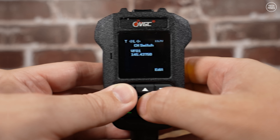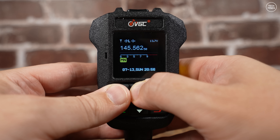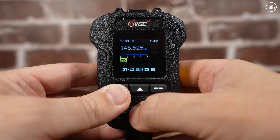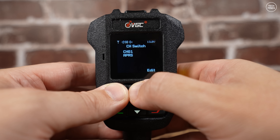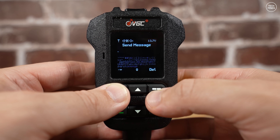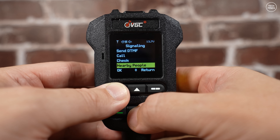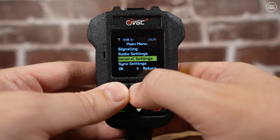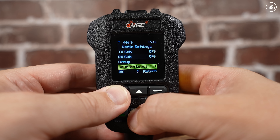In summary, this is actually a strange radio - I just don't know where I would place it in any radio lineup. It's mobile size for sure, it has great high power output and great spurious emissions. The features available with the companion application provide a lot to tinker with, but whether these are features we'd use on a daily basis will depend on the individual. For me personally, the KISS TNC is a win-win feature, and the N7600 will now be a permanent setup on my shack desk for when I want to experiment with packet radio - it saves digging out the old TNC and hooking it up.